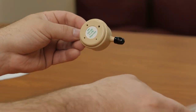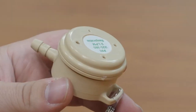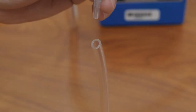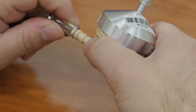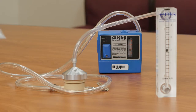Remove your calibration media from its sealed bag and place the calibration adapter over the face of the PPI sampler. The small tube connected to the calibration adapter will connect to your calibration unit, and the tubing of the pump will be unraveled and connected directly to the PPI sampler. Once your flow has been checked, you may begin your sampling event.